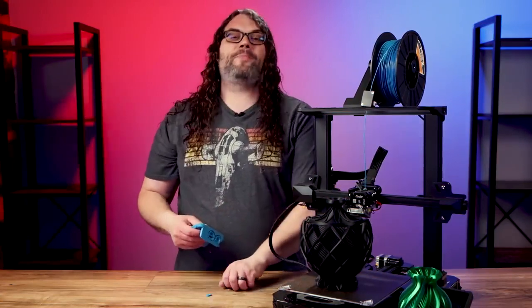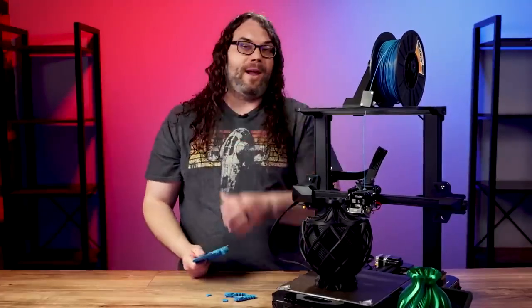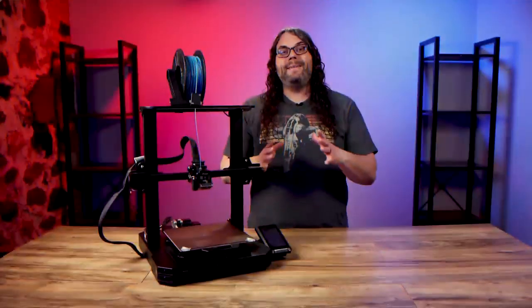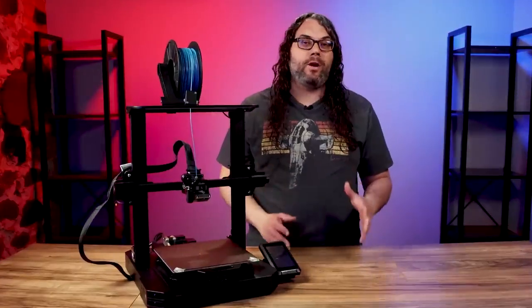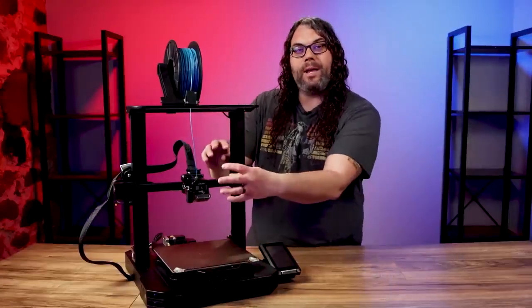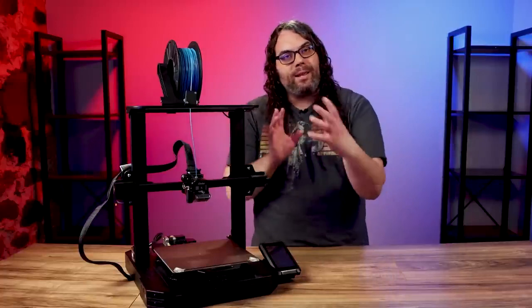Overall the prints came out great, but there was one that didn't — the Clock Spring Torture Toaster. A couple of hours in the extruder jammed, causing it to stop printing and just print in mid-air, and obviously the print failed. I'm not sure why this happened, but I did get the extruder unjammed. It was actually a little more of a chore to unjam this extruder versus the typical Creality hotend — but that's the deal with direct drive extruders. It takes more time to take it apart and clear the jam because everything is all together right here, not two separate pieces.